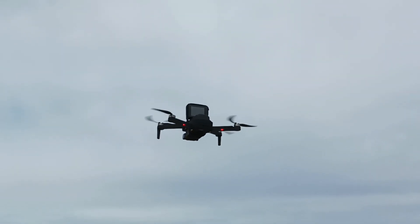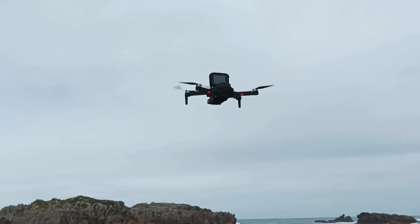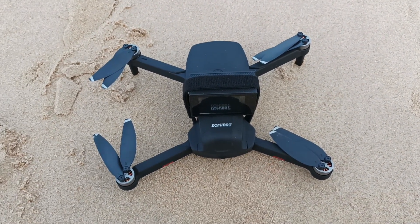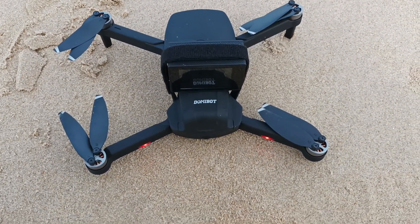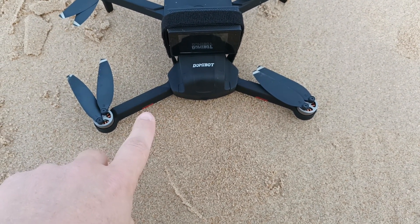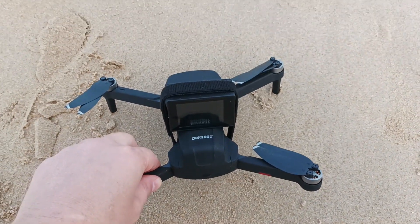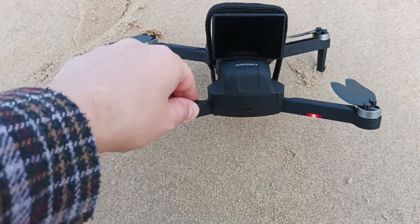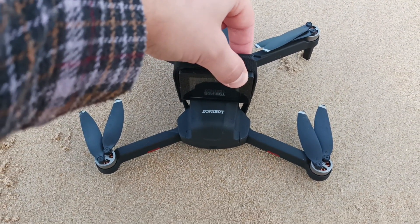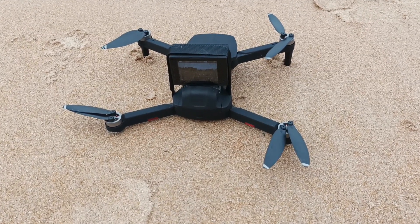So now we see that it's flying, everything is good, and we can turn on the camera and try to shoot some videos. Okay, now I'm observing a problem here — my drone is not able to connect to the GPS signal. When I turn on the camera and start recording with it, it loses the GPS signal, and when I turn it off the GPS signal comes back.